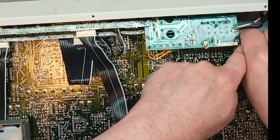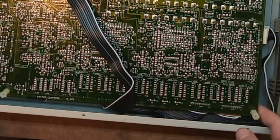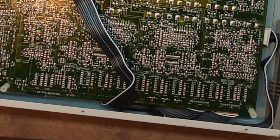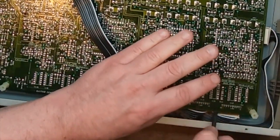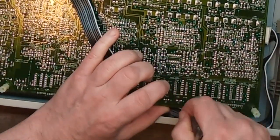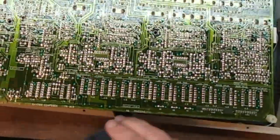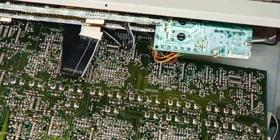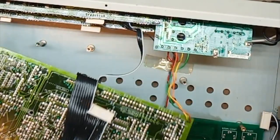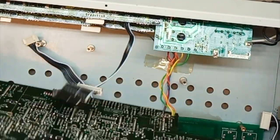Let me show you the things that aren't so easy. The first thing you'll encounter is getting the main circuit board out, because of two ribbon cables in the corner that are in the way. You can bend them over to get it out, or disconnect them using a screwdriver to fiddle them out. However, all the power supply leads — from the mains contact, the main switch, and to the circuit boards — are all soldered in, so you can't remove the boards entirely without desoldering.